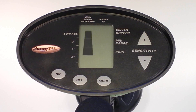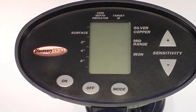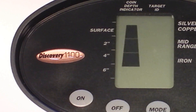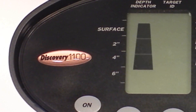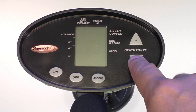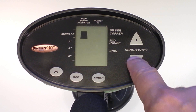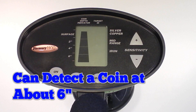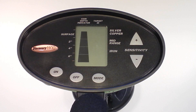The left side of the display has a dual purpose. First, it displays the sensitivity level. Upon power-up, and after pressing either the up or down sensitivity pads, the pyramid-shaped display indicates the detector sensitivity level. The sensitivity level can be changed using the up and down pads. At maximum sensitivity, the unit can detect a coin-sized metal object buried about six inches beneath the surface. Larger objects can be detected much deeper.